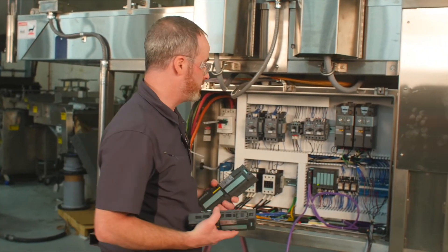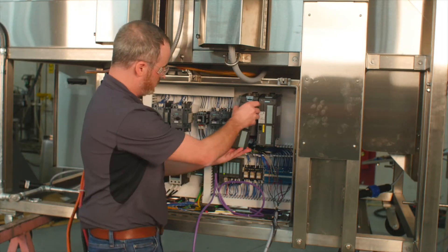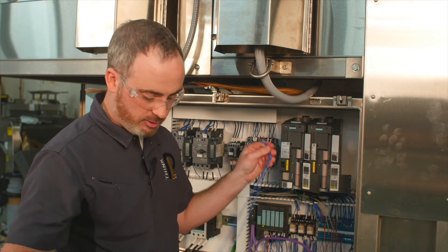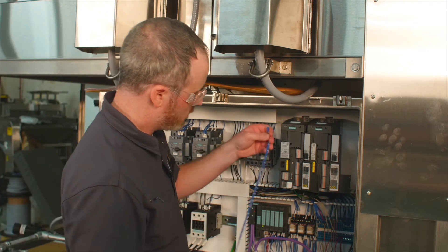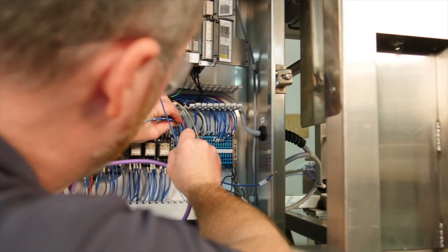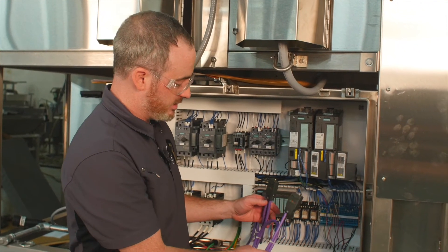Install the control units: take the hinge back, place in the holes at the front first at an angle, and simply snap the top. To get 24 volts on the power modules, connect to terminals 31 and 32 on both units. Run new wire with labels 24V1 and 0V, routing them neatly down to the terminal blocks below. Use a flathead screwdriver in the square hole to pry down the spring-loaded terminal, feed the wire in until it stops, release, and tug to confirm a good fit.